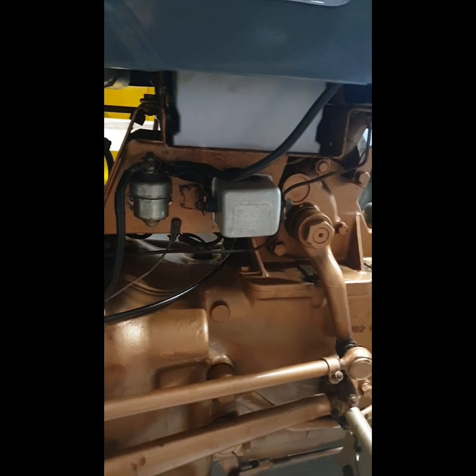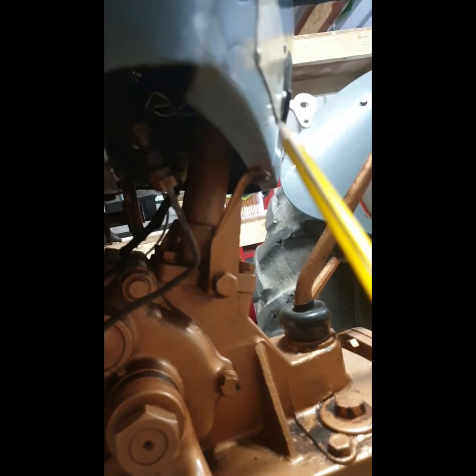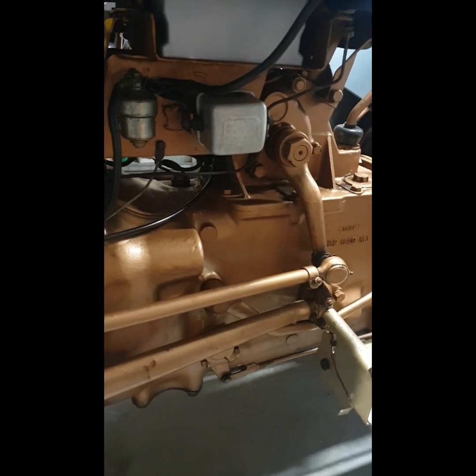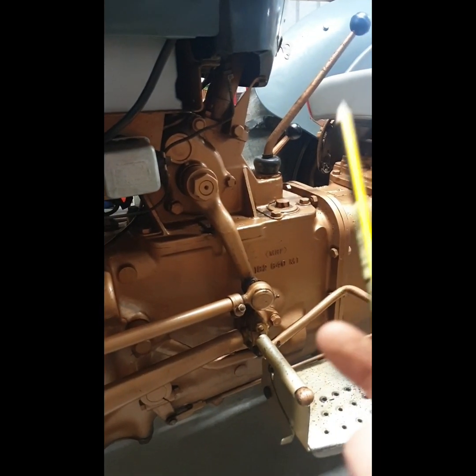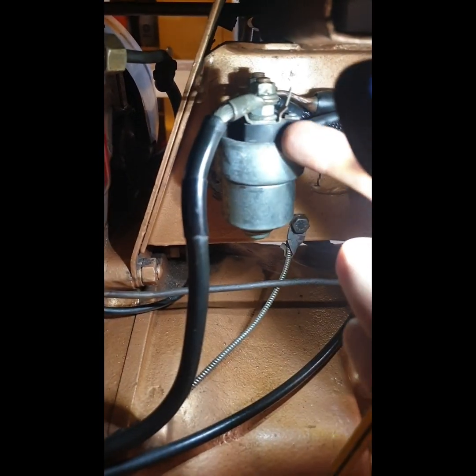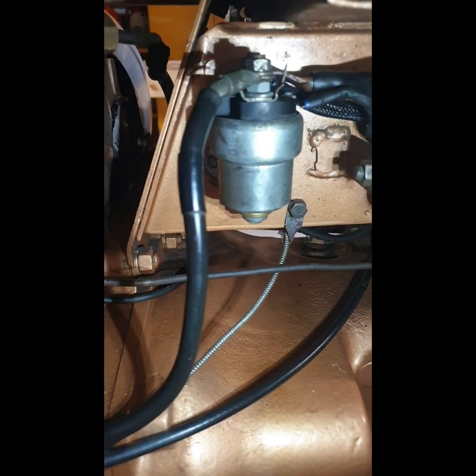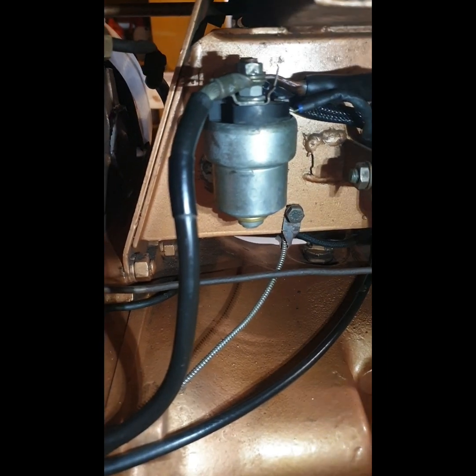So it is looking good, apart from, again, I just have to test this white wire going to the coil. Sometimes the connections in behind that, in that key switch, can get a little bit worn through arcing, and through years of power flowing from one side to the other. Now, I would love to open that up, but I was looking at the back of it, and it'd be very hard to open it up. It's something similar to the solenoid here, where it's burred over, and to actually get that all prized back without breaking the plastic insulating material there would be fairly impossible.